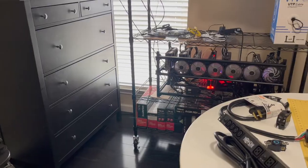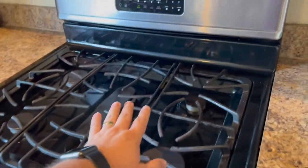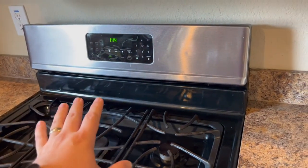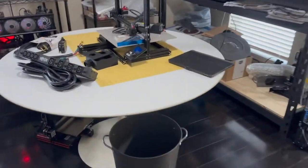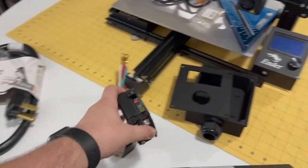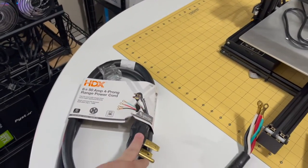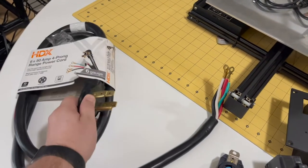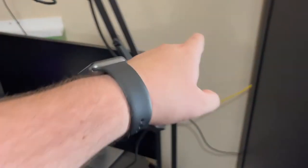Let's get into the plan. This right here is my stove — I have a gas stove. Behind this stove is a 50-amp plug that I'm intending to tap. I'm actually going to lower it down to a 30-amp plug. So I'm going to change out the breaker and put a 30-amp breaker in — down from 50 amps. I have a 50-amp stove plug that will match my plug in the wall. My plan is to plug it in, run this through my wall, which is right here, coming in behind the stove.